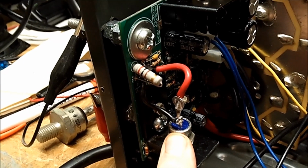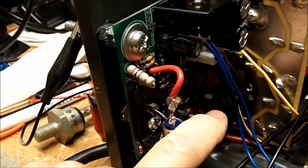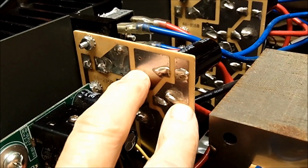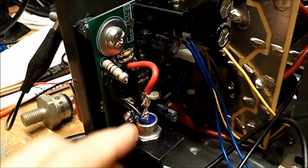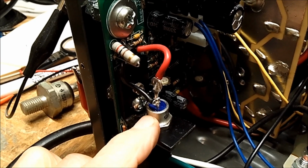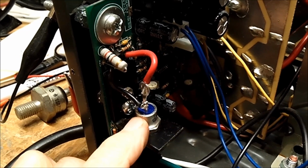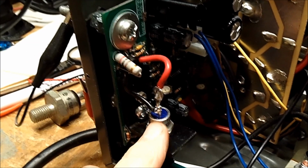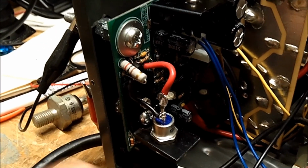Maybe this thing is shorted. It might be shorted out. It's not running hot. It's not causing these diodes to run hot. I'm still getting my voltages here. But if this is shorted, it's probably only going to be good for one time and that's it, because, like I say, it's too small. That might be good enough for maybe 20 amps, and I'd find that hard to believe too. But I don't think it'll handle 60 amps clamping. So if this is the circuit, the way I understand it, a crowbar circuit is a sacrificing circuit. In other words, it'll crowbar one time and that's the end of it.